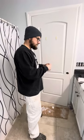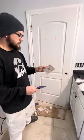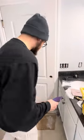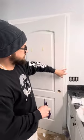We're going to prep this door for paint. We got a couple things: a 3M gray sponge — 3M makes these super fine and fine sponges, they're great for light sanding. We got some 220 here for some heavier sanding. We had some really worn out 80 grit for the sides of the doors where these doors were brand new.